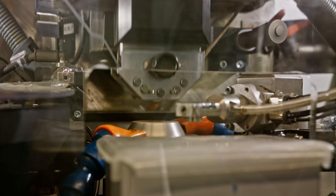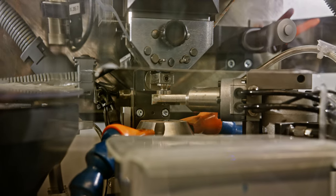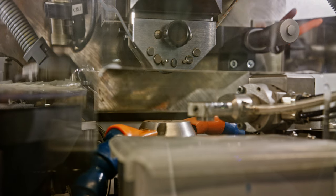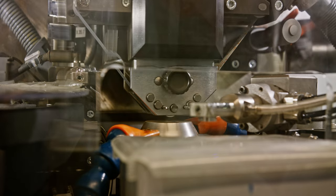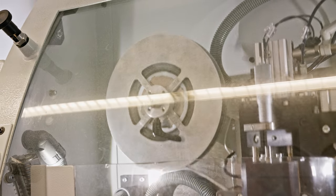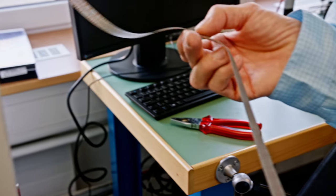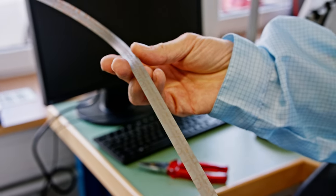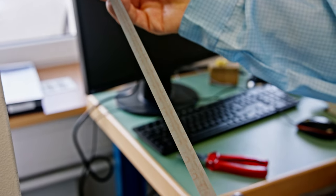What you see on screen now is a machine that does surface treatment on the pieces cut out from the lathe machines. You want them to look good, and here it is done automatically — the robot arm brings the piece to be treated and turns it around. That's not a film roll — that's sandpaper. It's automatically moved forward, the used sandpaper comes out at the other end, and you can see the very fine sandpaper with traces where they've been treating the surfaces of the little wheels.